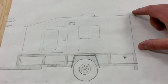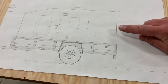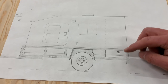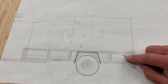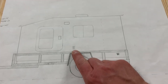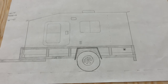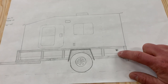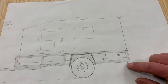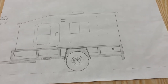There's going to be a hatch on the back that opens up on some gas struts with a 4-foot by 4-foot square opening. My plan is to have two intermediate shelves across that area. There's a shore power connection, and when connected to shore power — which is most of our camping — there'll be receptacles in the cabin area for charging phones and whatever we need. There'll also be an exterior receptacle on each side. The shore power connection is shown on the driver's side, though it doesn't really matter. We carry a pretty long extension cord.